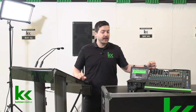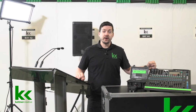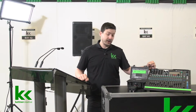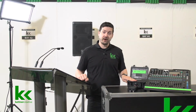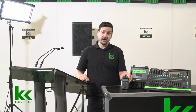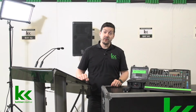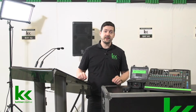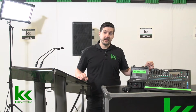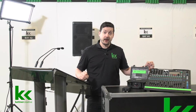Typically when you're at a press event, there are many different things to keep in mind. Not only are you mixing for the guests that are at your event in person, but you're also feeding a press box for all the cameras to plug into, and you're also taking your own recording of the audio after the fact as well. Each one of those outputs requires its own nuance and its own tweaks as far as audio is concerned, and you can get them a lot easier out of a digital audio console than you can out of an analog audio console.